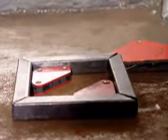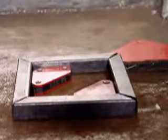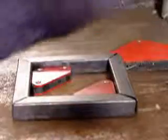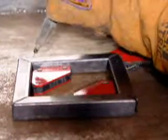I'm trying not to squeeze too tight. Now, as you can see, I just zoomed in on the corner — just a little bit so you can see all four corners. I'm going to go around and tack each of the corners. I've got my ground clamp clamped to my table. I've got my welding helmet on and my gloves. Once I've got all this stuff on, we're going to get to welding. I'm going to start up here in this corner and give it a quick tap.